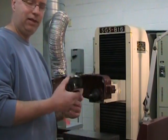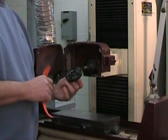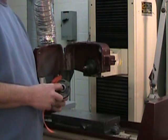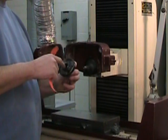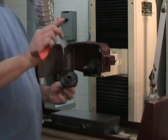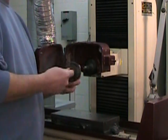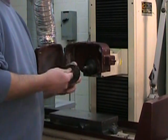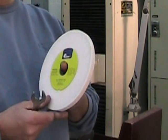Now that I've removed the second flange and inspected it, I can see that the female taper and the male taper have sustained some damage. During the crunch, the flange spun on the spindle, scratching and marking both surfaces. So I'm going to use a medium grit emery cloth to polish out those marks. I've already rechecked this spindle with the dial indicator and everything should be all right. We can say that we got lucky that the spindle didn't bend.